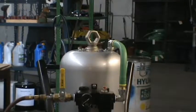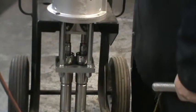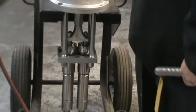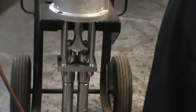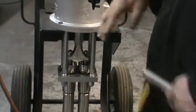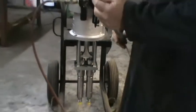When the king pump stalls on the downstroke every time and you're having problems, when this is all the way down, when it's stalling down on the downstroke, there's two issues. You could either have a bottom end unscrewing or the trip rod came out of adjustment.